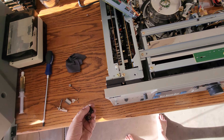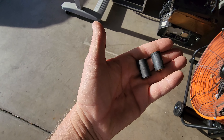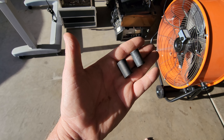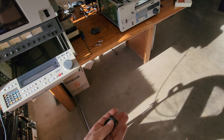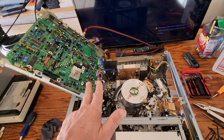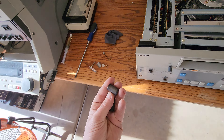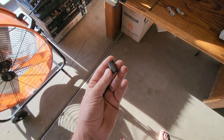The second problem is I've got to rebuild his capstan roller. When the rollers get bad, they get very glazed. The one on the left is the replacement newer one. The one on the right has got all these little dimples and everything else — it's hard as a rock from sitting, just bad rubber from the time or probably how it was cleaned over the years. We've got to replace this roller. When you have really bad rollers and you don't check them, when it's engaged it will start leaning towards one end — up at the top or at the bottom — creating the alignment to be off and playback to be off. The tracking is just a complete mess. If the rollers have giant dimples or cracks, like this one here — it's sunken in in spots — I knew right off the bat I have to change this out because the playback is going to be lousy.